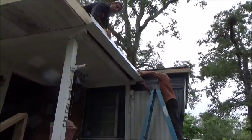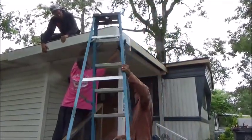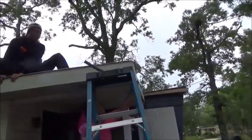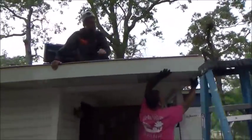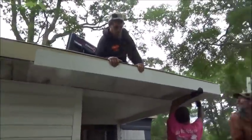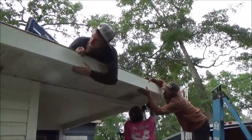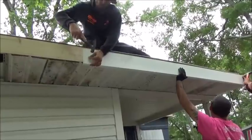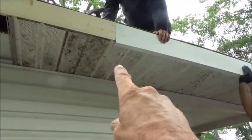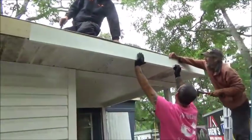Sliding a piece of metal down. Just don't nail this in down here — that way we can get it back. Pull it up nice and tight. What we want to make sure is that the piece of metal that goes in about an inch is just level — like it's supposed to be. You don't want to push it too high.